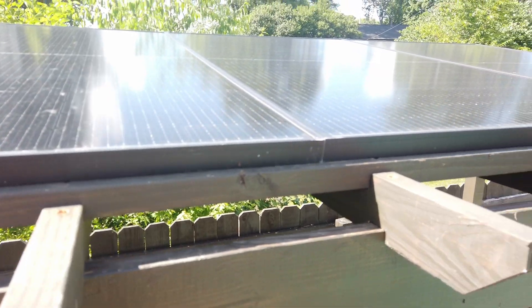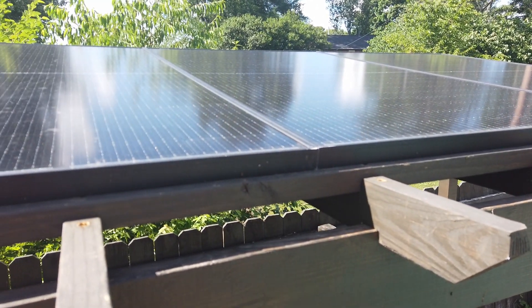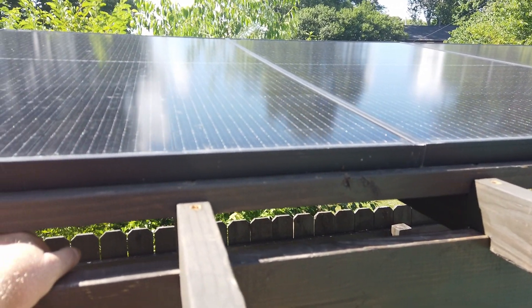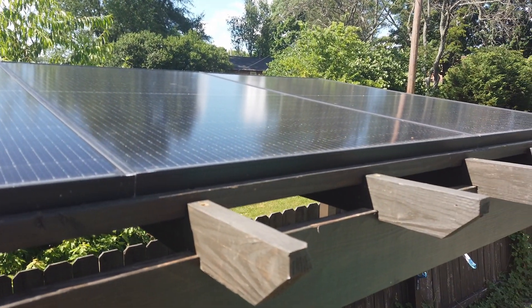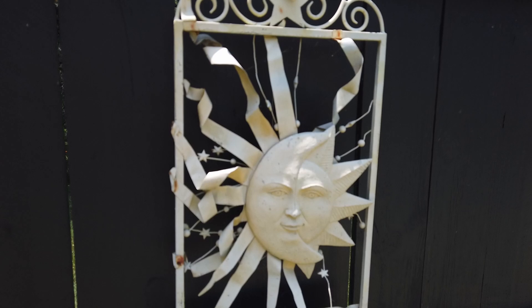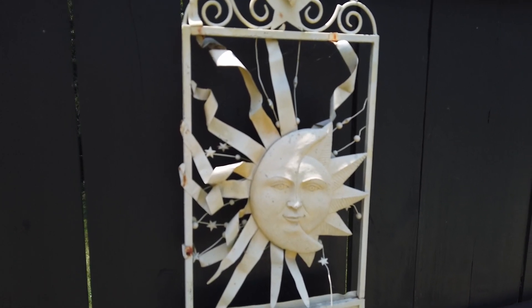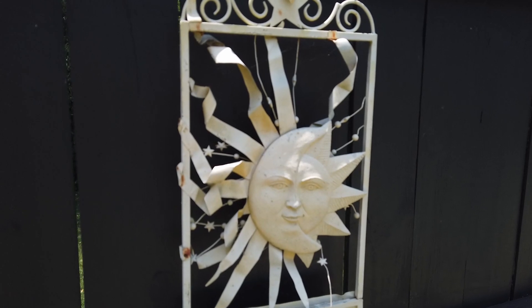As far as the solar goes, it's still doing great. Solar panels usually last 20 years. This setup is 370 watts, three panels in series, with a VOC of about 41 volts — and I found that's exactly what you need. The motor never runs hot and it's been working great.